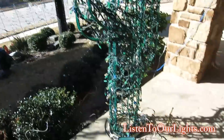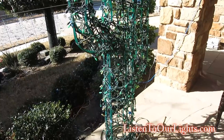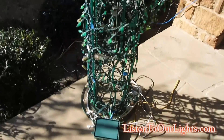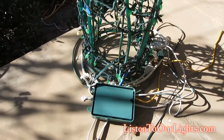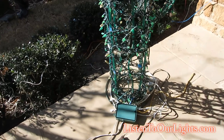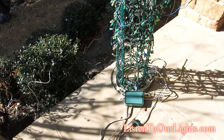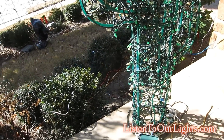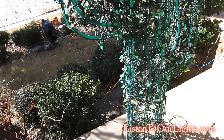The other serial output drives the cactus. I put it on its own serial output because it's pixels now — only 100 pixels, but I wanted it separate to be safe. These are old; next year I'll put new pixels on it. It's currently running the old Light-O-Rama CCB, which is essentially the same as the CCRs. To get that working, I just hooked it up to the hardware utility, disabled macros, and it controlled the lights fine. It hangs off one of the serial outputs of the Falcon F-16 V3.